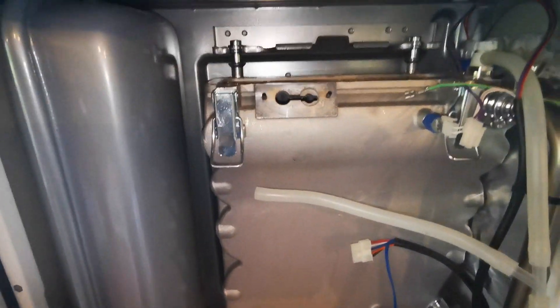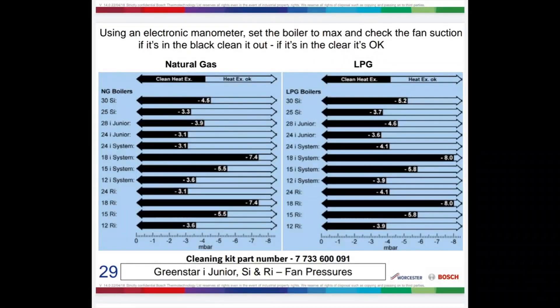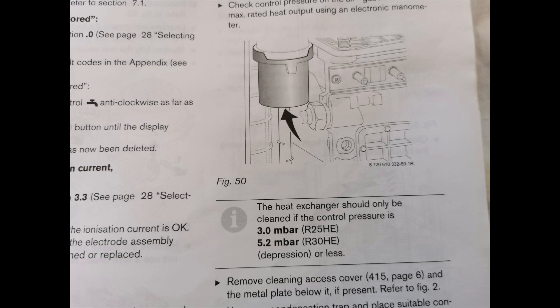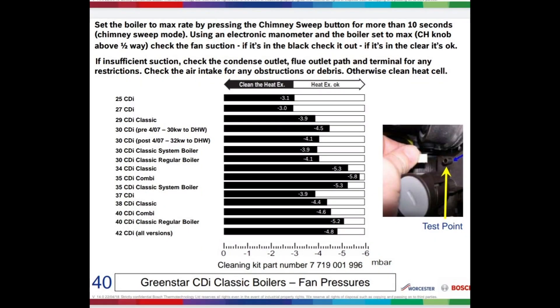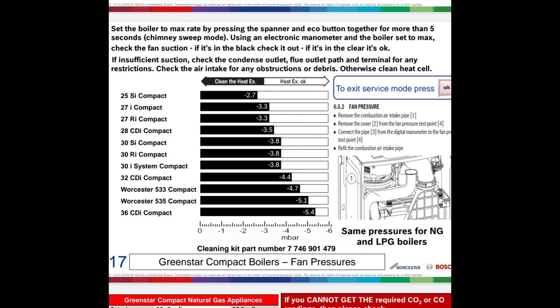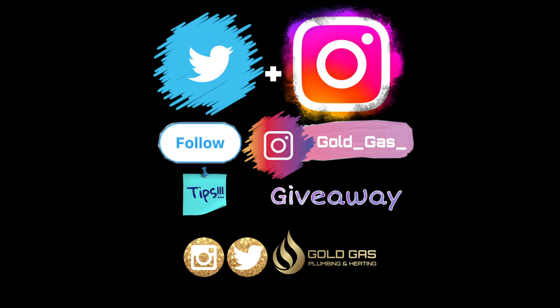Check the flue duct as well — I've got another video where there was a screwdriver in the flue duct causing a poor negative reading. The flue turret doesn't often block up, but you might have a washer in there restricting it. Check the flue length — make sure it's within the allowed length; if it looks too long, refer to the manual, as each boiler model and output will be different. Make sure there's nothing blocking the terminal on the outside. If still an issue, start replacing components — burners on the Intec often need replacing as they get too blocked for a compressor to clear. Call the manufacturer with your model, serial, and GC number and they can help.